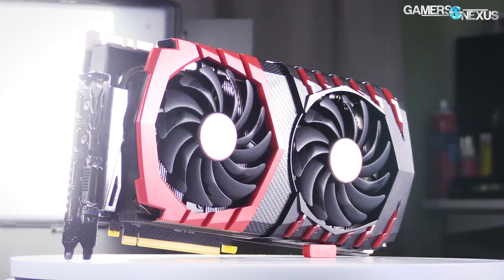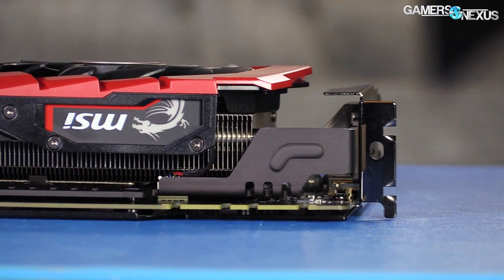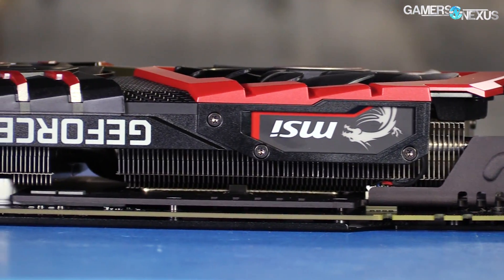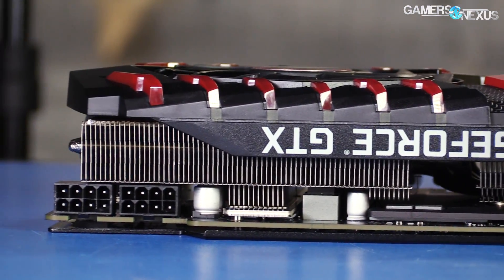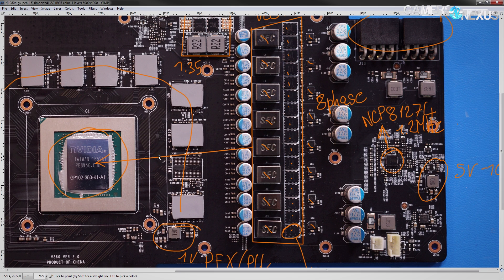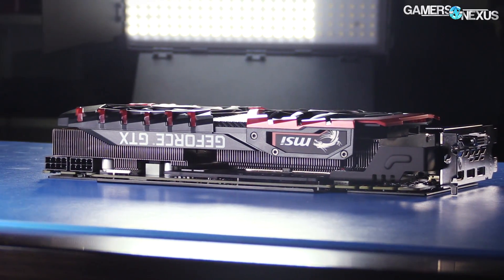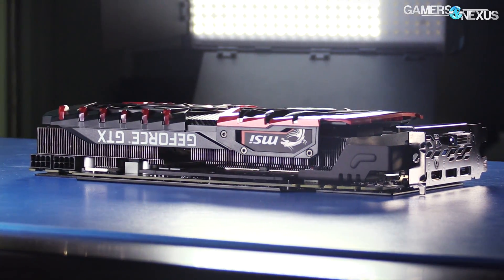MSI's $750 GTX 1080 Ti Gaming X is one of the most overbuilt cards we've looked at lately, particularly for its seemingly excessive thermal solution and use of 16 vCore VRM dual-FET packages from Fairchild — specifically the FDPC5018SGs — controlled by 8 driver ICs for an 8-phase VRM with 4 MOSFETs per phase. The VRM is capable of sustaining a 250-amp load while outputting just 15 watts of heat at 125°C. Even 400 amps would keep us to 40 watts of heat, thanks to how much the phase design spreads heat over a large surface area and high count of FETs.